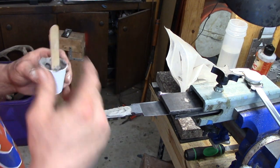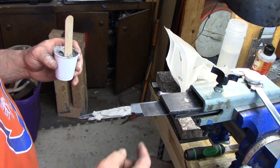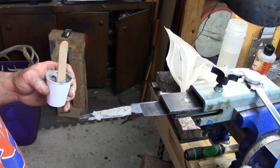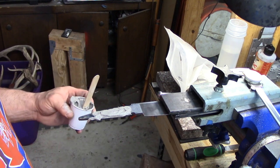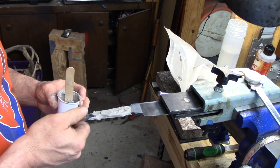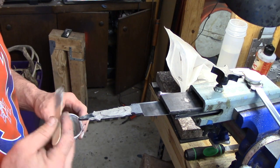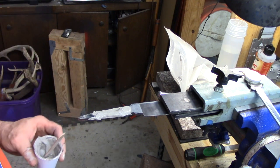I don't put it on the rest of the blade yet because once this dries you want to make sure that you're pretty even all the way around — you don't want any high spots or low spots. Once this hardens for a couple of hours, I'm going to take the blade to the heat treating oven and coat it with Brownells all along the ricasso and all the way out through the blade. That's going to stop deep decarburization and prevent any scale buildup. If there is any scale left, it'll come off really easily in boiling water. I've left about an inch at the end of my tang so I have enough area to hold with my tongs going in and out of the oven. So I've got this tang coated pretty good, pretty even with Satanite. I'm going to cut this off and let this harden.